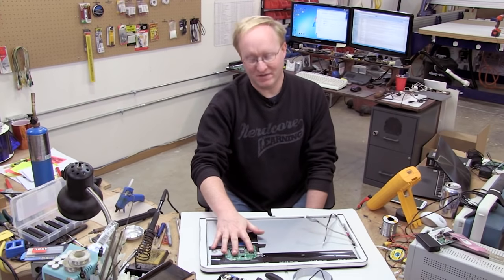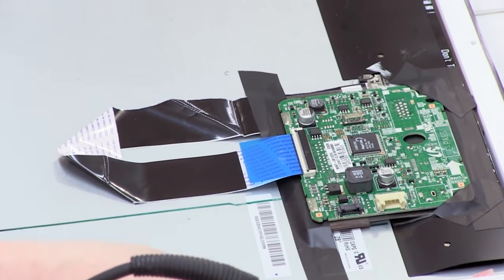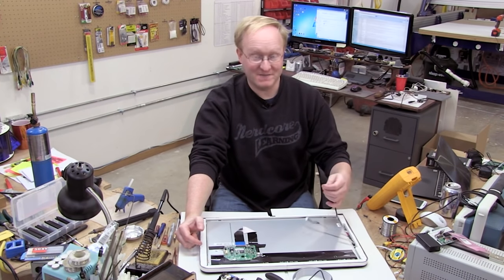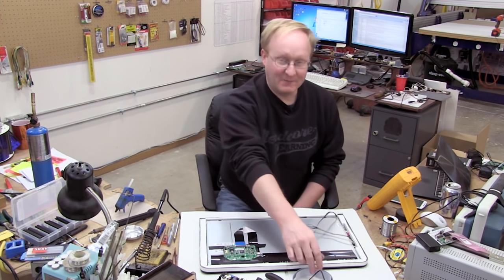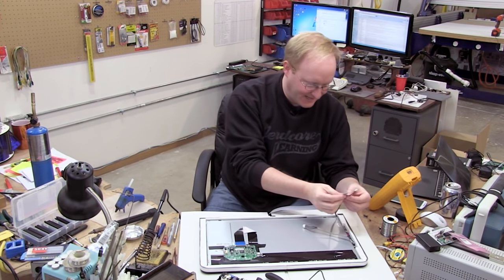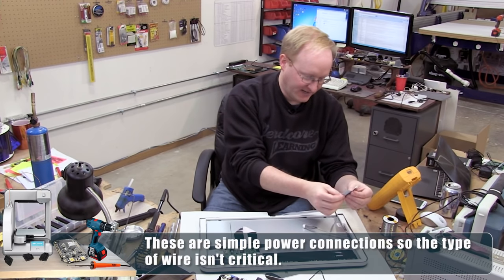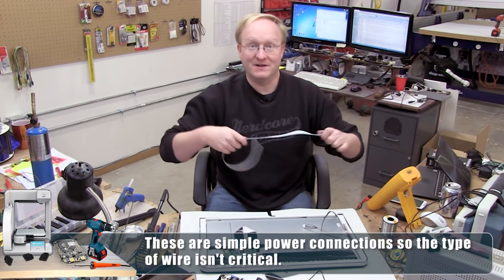This is the best place to put the PCB for the screen, but it's no longer in range of the control buttons or the LED backlighting, so I'm going to have to extend these wires over to the board. I'm going to use this ribbon cable, which is about 26 gauge I think. It's actually a little thicker than what this is, so it should be fine — it should have a perfectly decent current carrying capacity.